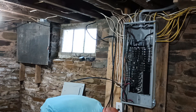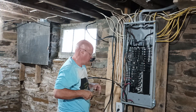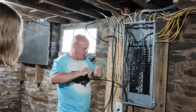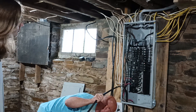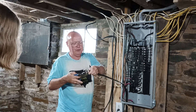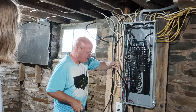What I'm going to do now is strip our wire. I'm going to take my wires out of your box and just strip my end like that. Just make sure you don't cut the wires underneath, Jake. That's why I rip it just at the very, very end. And now this is just NM cabling — this is just for indoor use. You cannot use NM outdoors.